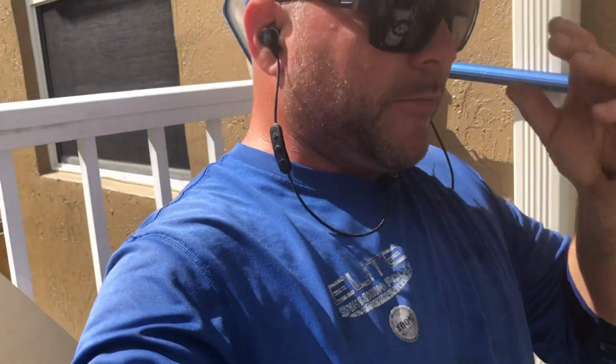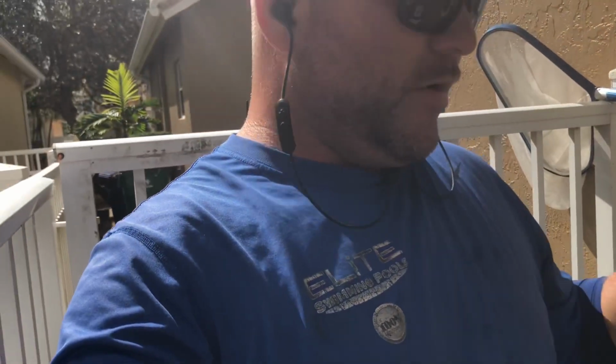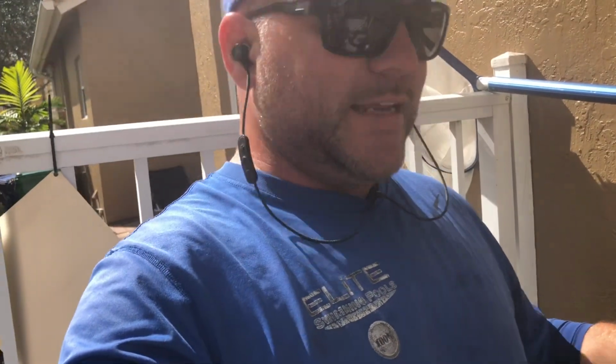Pump lost prime, and when a pump loses prime and the motor's still running, the components on the inside of the motor overheat, and that capacitor is overworking itself and getting overheated, and with heat there's always loss of energy. So that's what I think happened here. The motor's been off over the weekend, so about 2-3 days.